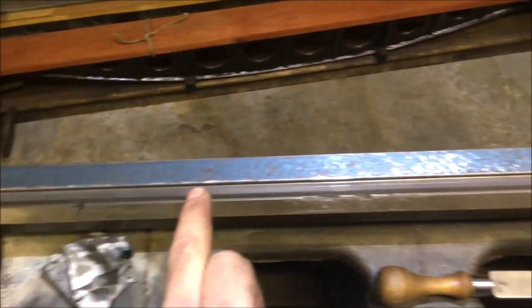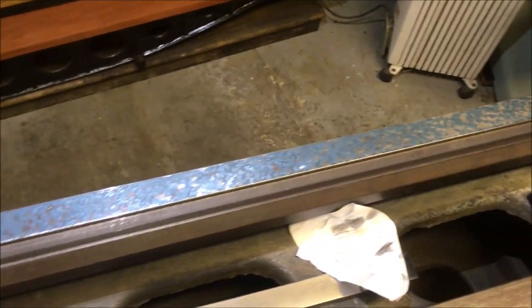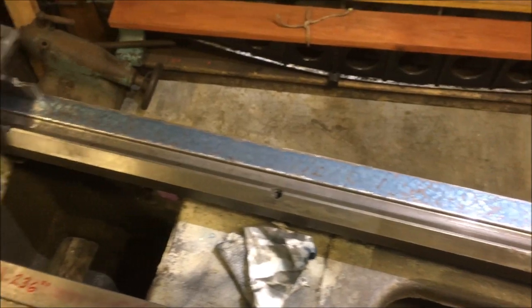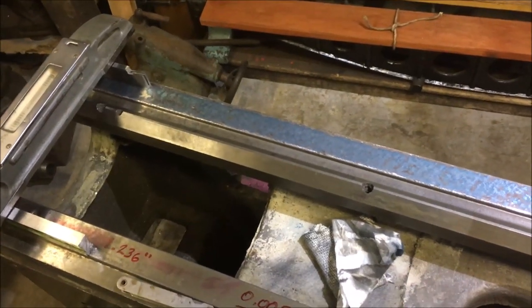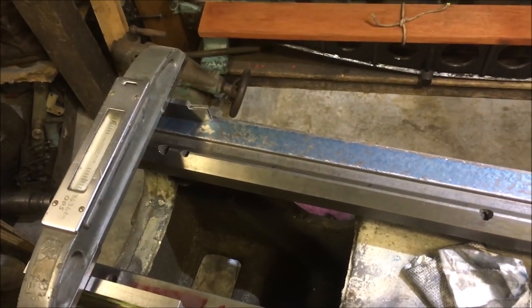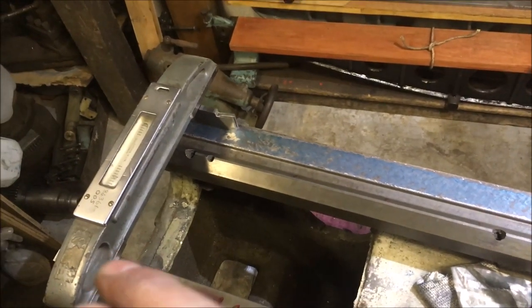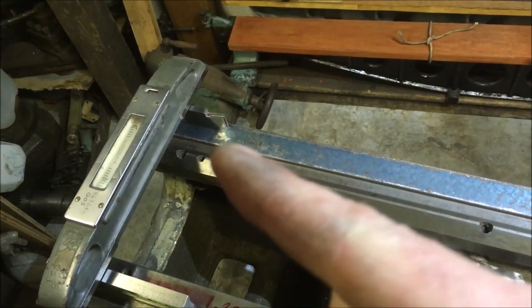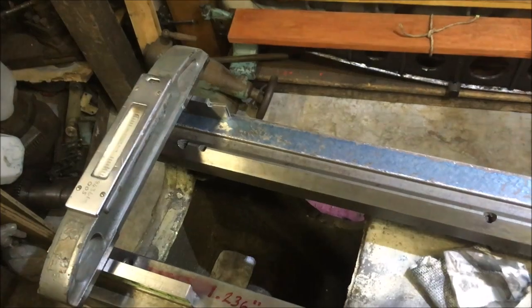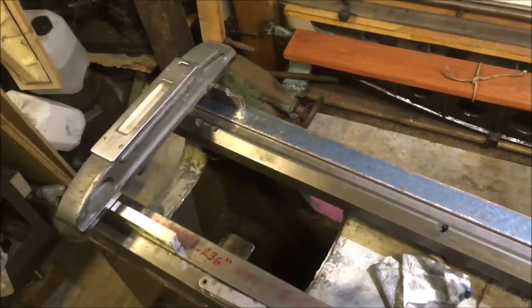Well, I'm happy to say that that surface is now scraped in and ready to go. It's not in its final points per inch, but it's good enough to take references off. I've then measured how much I've taken off, verified that I actually read the micrometer wrong in the first place on several occasions. I've rechecked all that and I've taken off 5.5 thou there. I've confirmed that by using the original spirit level setting, which I had levelled up, made up an adjustable parallel to compensate for what I've taken off, and brought it back into parallel, and it measures up 5.5 thou with the same mic.